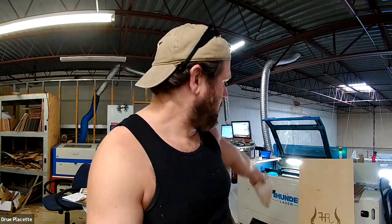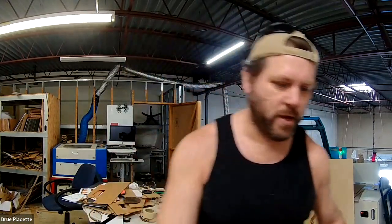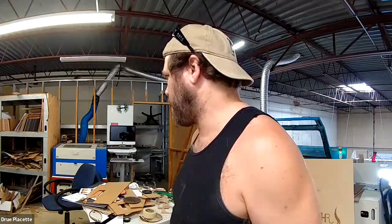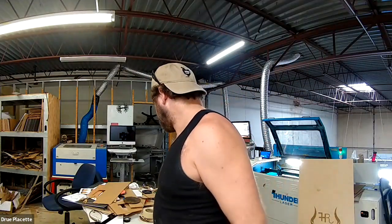These guys, like this big laser here, it caught fire, and I rebuilt it out of old plotters because I couldn't get parts during COVID. So I literally ripped apart some old plotters, took the belts and other things, and then used some stepper drivers. So it's stuff you can do with the Maslow that you can't do otherwise. It's really cool. So the frustrations can be good.